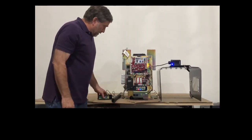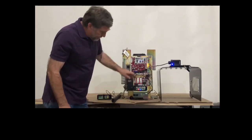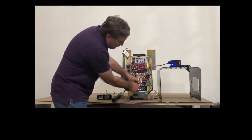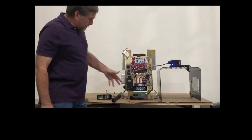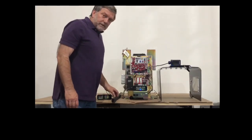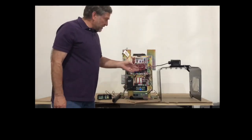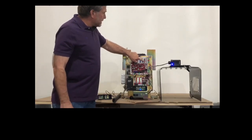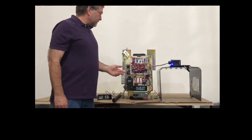The board, fairly soon, is going to recognize that these two are paired. Oh, first, let's take this out of learn mode. Press and release the learn button in the monitored receiver one more time. The board just recognized the pairing. There's a valid monitored safety for our open direction. The lights stopped flashing, and now if we hit one of our green test buttons, our gate should move.